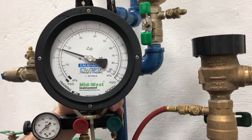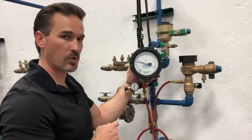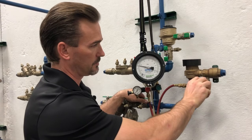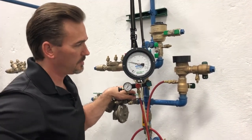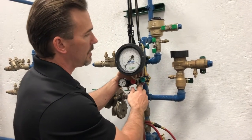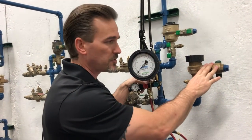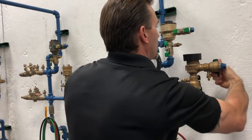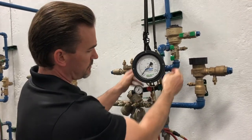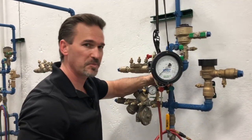We've about stopped on test port number 2 and our gauge is holding right at 2.6. That's a good gauge reading because our minimum for our check valve is 1.0. For test completion, we'll close both test ports 1 and 2, disconnect our hose from test port 1. We will open shutoff valve number 1 first, and now shutoff valve number 2 to pressurize our system. We'll open all the gauge valves on our gauge to drain it down. And that concludes this test. I hope this helps you out. Thanks for watching.